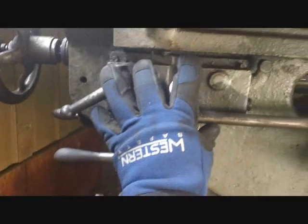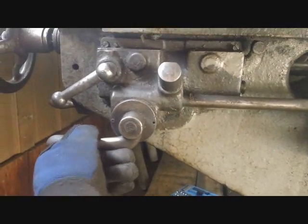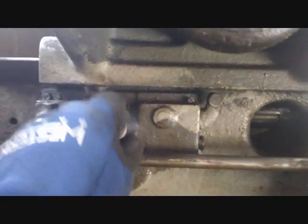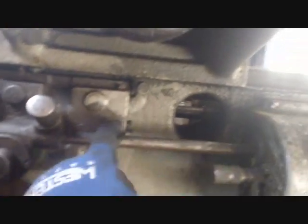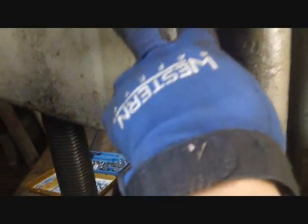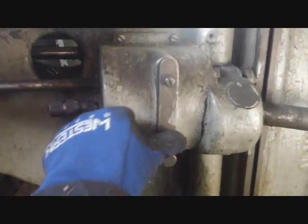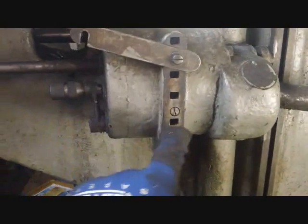That comes over to this assembly on the side, which engages the feed. I loosened up the screws and this looks like it might come off, except it almost feels like something is holding it inside - meaning I'm going about this all wrong - or this lever just doesn't want to flex. That made me try removing this other piece. I found two screws up here and two screws down below. This section almost looks like it's part of the casting, part of the knee, and I don't see where it splits - but it moved a little.